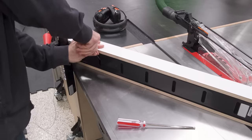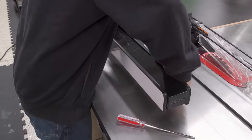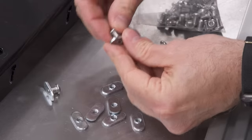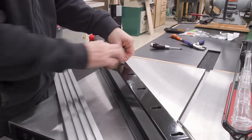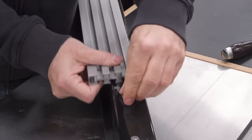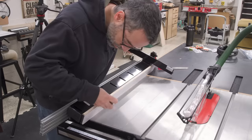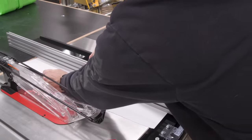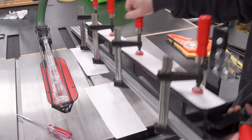I'll remove the face of the fence via the access slots on the underside. The way these connect kind of sucks as it's really difficult to turn the socket cap screws that hold the face to the body of the fence. The stock fence face wasn't really that bad in terms of flatness, but once removed from the body to attach the extrusion, I'll use quarter-20 oval nuts and some small three-eighths socket cap bolts — they need to be short or they risk bottoming out in that T-track. The bolts just barely grabbed the metal around the keyhole slot; it works, but you have to be patient with placement. I'll snug up the bolts while keeping the fence just a little bit loose, then use paper shims to raise the extrusion slightly above the table — just high enough that it doesn't cause interference with the surface, but not so high that workpieces can slide under it. I can then clamp it in place, turn it over, and tighten the bolts.